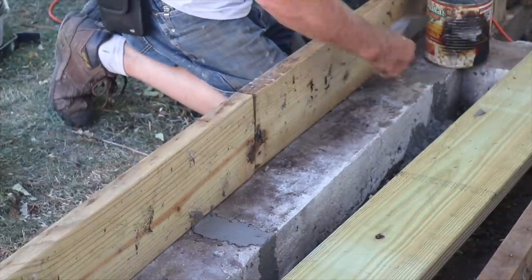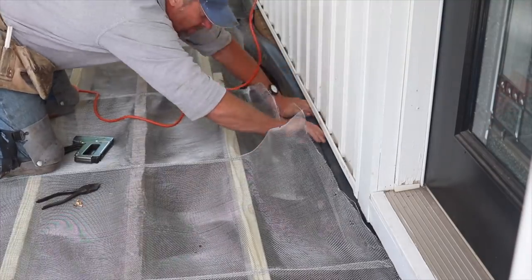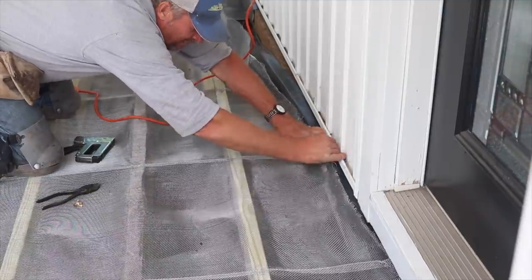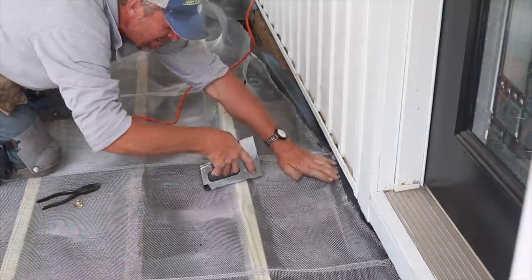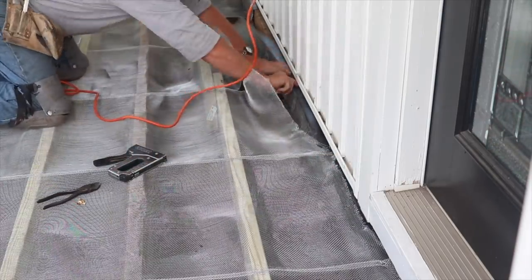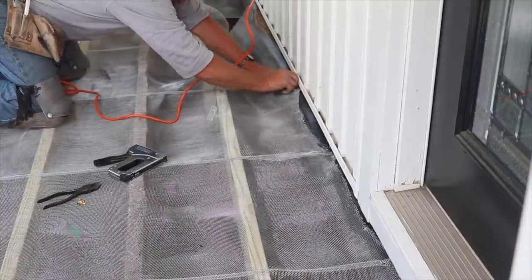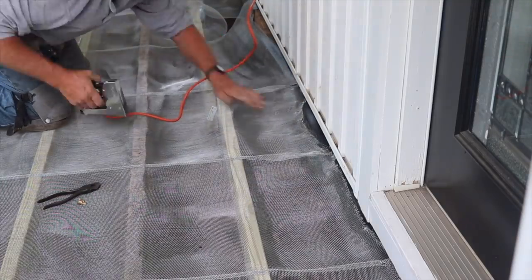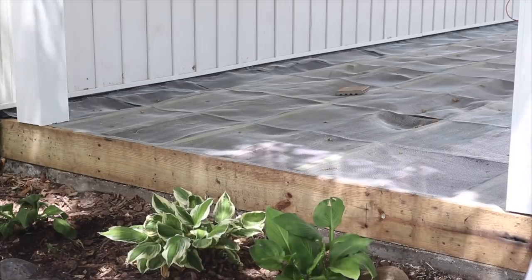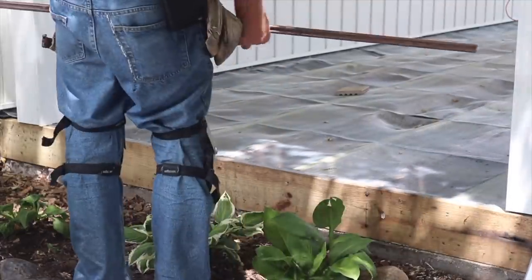When we filled the hole underneath the door, we also had a ton of bumblebees start coming out, so I think we covered a nest. We did another precaution — we added some flashing along the house so that moisture doesn't get behind that joist and rot it. And then this netting, which I bought as an 1/8 inch steel wire mesh netting, we're stapling down into the joist as well as the flashing, getting everything covered up so that when we lay the decking on top of it, it's going to hopefully prevent any issues with unwanted house guests.